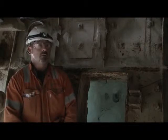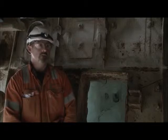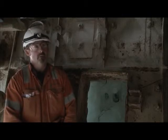The benefits in using the precast blocks is that it only takes about 2 to 3 shifts to install these precast blocks into the arch, whereas before with the casting work, we'd use a lot of men putting buckets of cast in through the door and into the shutters. And that would normally take about 6 to 7 shifts to put into the shutters.